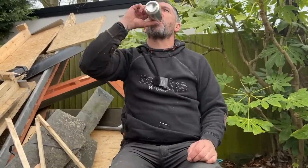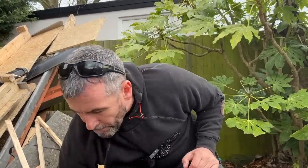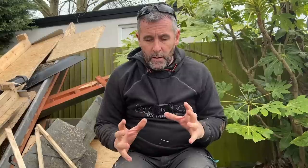Steve Pexman asks about superfoil insulation. Superfoil insulation is generally used in loft conversions where you're tight for space — and that's where building regs allow it. I don't know the precise thermal difference between PIR and superfoil, but if superfoil was better than PIR, that's what they'd be using on all extensions and house builds. It's generally used in lofts because you've got tight spaces.